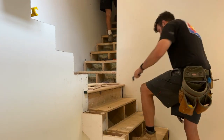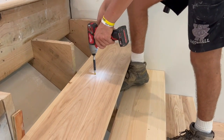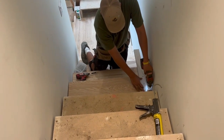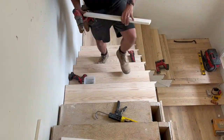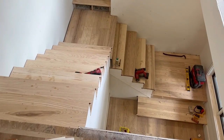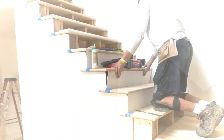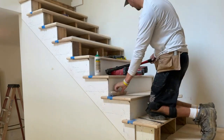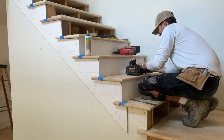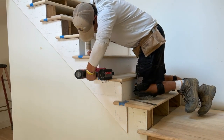Finishing the floors is a significant milestone because of how much work we put into milling them and how great they turned out. But having the floors completed also allows us to finish the kitchen and the stairs. To build the stairs, Drew and I teamed up on the volume work while Smitty took care of the craftsman portion of the stairs. The first move was installing the treads — replacing the old plywood stairs was extremely satisfying. Next, Drew and I installed the riser boards. Working through these stairs, Drew and I recognized how much tool and hand skills we had developed through the summer of finishes.